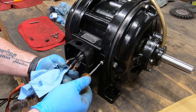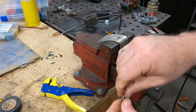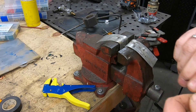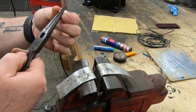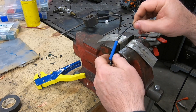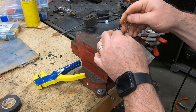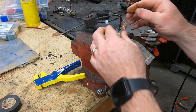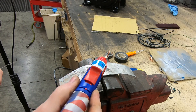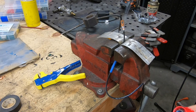This 80-year-old insulation is not in perfect shape. The three wires between the motor starter and the motor were originally 12-gauge aluminum solid wire. I have opted to replace those with 12-gauge stranded copper wire. To make the connections inside the pecker head more secure I am soldering copper terminals onto the end of the stranded wire, using a little mini hand torch and some solder to do this job.